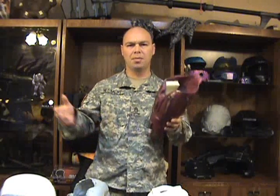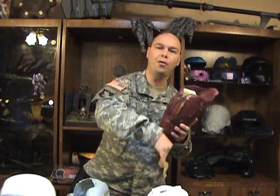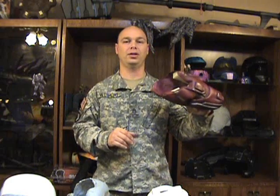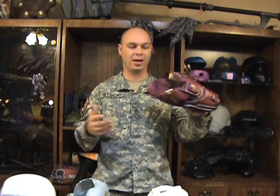Now, what I was referring to as far as going past your edge: everybody knows that people try to bring your plastic to the edge, but you're always afraid of pouring over the edge. So you get just to the edge a little bit, and then you stop. What does that do? That creates very thin edges, and very thin edges chip and break, and it's no good. So build up past that edge, so you go to that new edge, which can stay thin because everything behind it, once you Dremel it down, is thick.